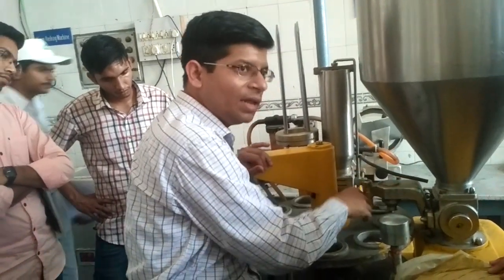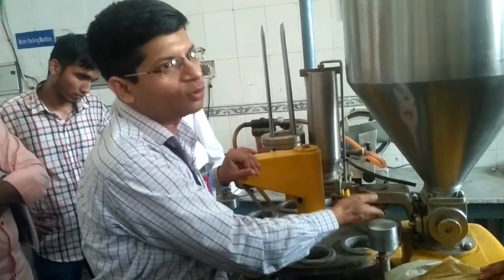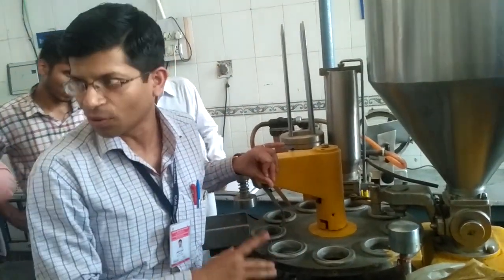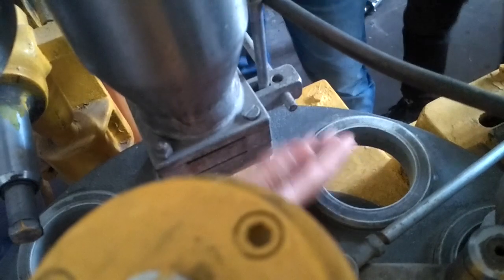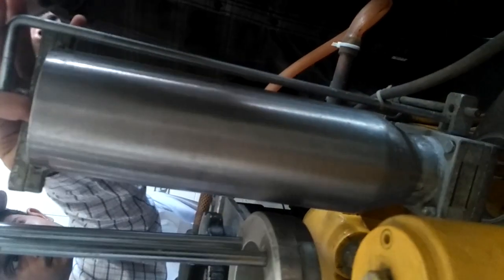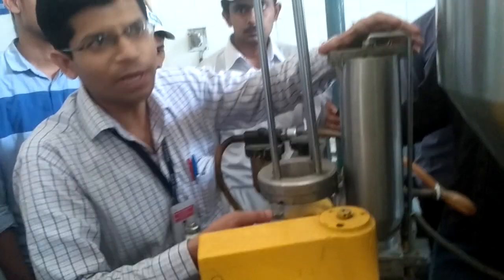So when this lid is open, only then this pump will start. When this pump stops, after that this lid will come back into place, and until that the turntable will not rotate. When this operation has stopped, the turntable will move to the next spot, which is again an empty slot. After that in the next place, there is a fruit and nut dispenser placed over this space — a hopper type shape which will be filled by fruits and nuts. Fruits and nuts will be dispensed from the opening underneath this hopper on top of the ice cream, serving as a topping over the ice cream already dispensed into the cup.